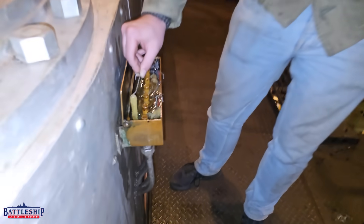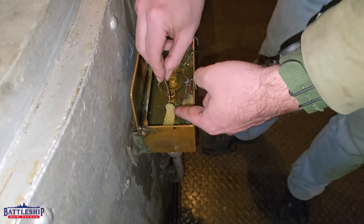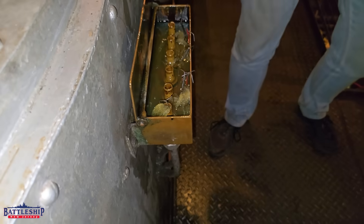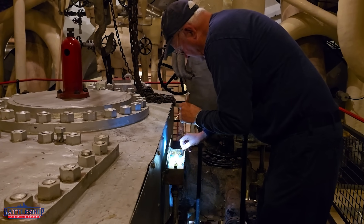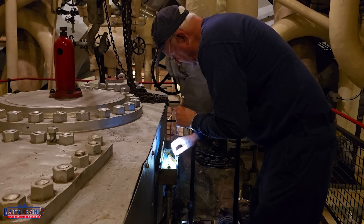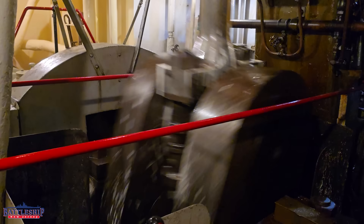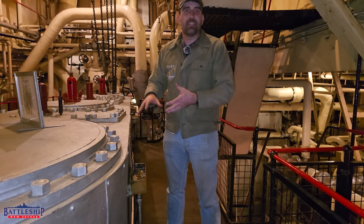Let me show you. You would lay this in the oil — so now you see it's largely submerged and absorbing that oil. Then you press this down here; the oil is being wicked up from the pot, down that hole, and it goes down this tube to wherever it's supposed to be dispensed. So the oiler has to come through periodically, top this box off, and make sure the wicks are still doing their job. If something happens and the wicks end up getting crossed or they don't sit in here perfectly, they're not going to drip oil and you're going to start to see your bearings and other surfaces get really hot down below.